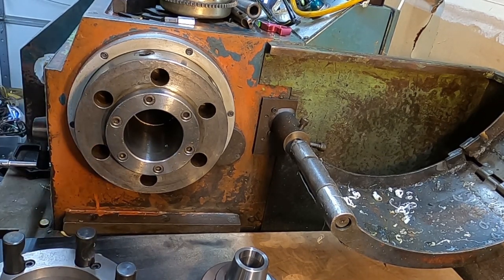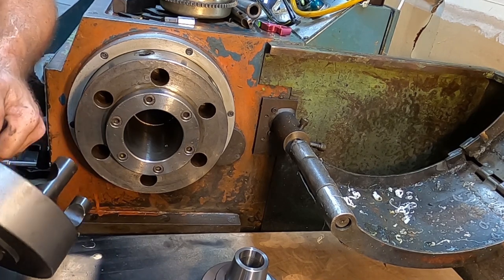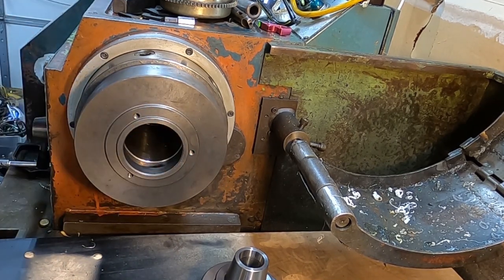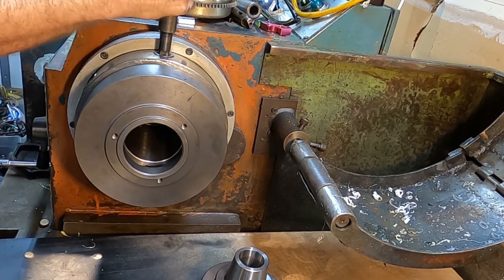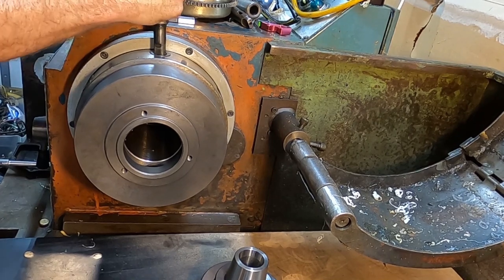The big bummer with this stuff is if you've never set up a chuck for a D-style mount, you don't know how it's really supposed to fit. Therefore, if it doesn't fit right and you bolt it together, you might not notice that it's not gripped correctly. And you could set yourself up in a position where it's really, really dangerous.